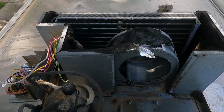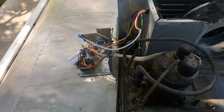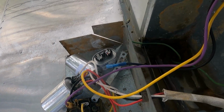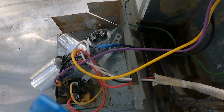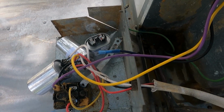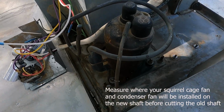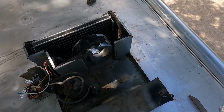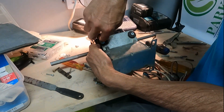And as you look around at the coils, I can see right through them, so that means they're doing their job. There's the compressor. And over here, he's replaced all of the capacitors. You'll see the smallest capacitor is the fan capacitor. And Sin's going to wire the appropriate brown wire on the fan motor. And we've understood that a white wire can go on there as well. So that's what we'll do with the fan capacitor, and at that point we'll try the motor and see if it turns. There's all the hardware sitting in the trough there, and it looks to me like pretty much we're in good shape to plug up the motor and get going.